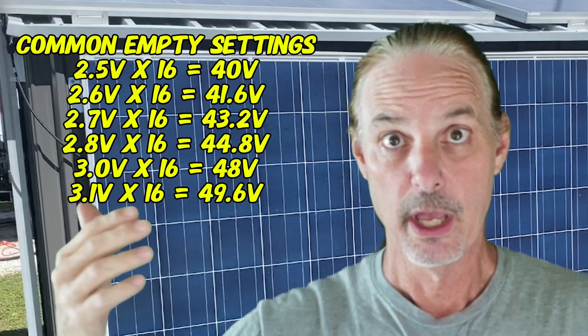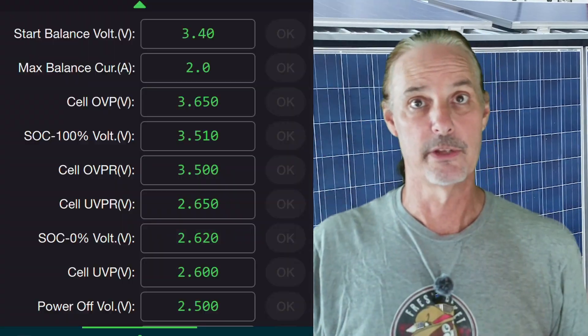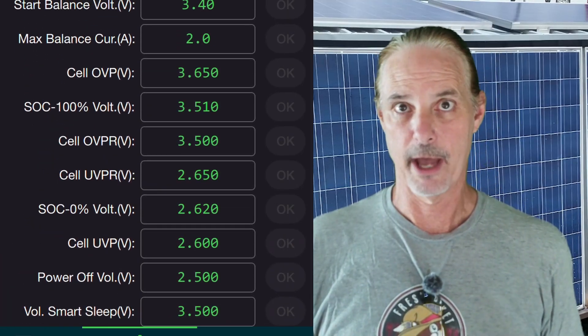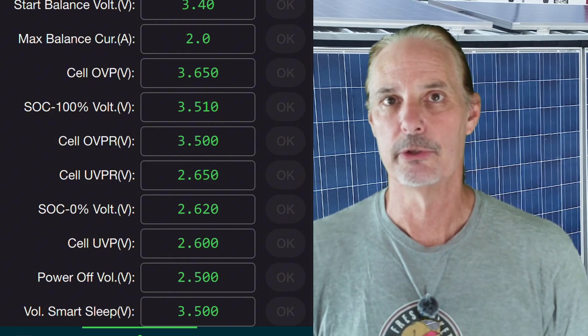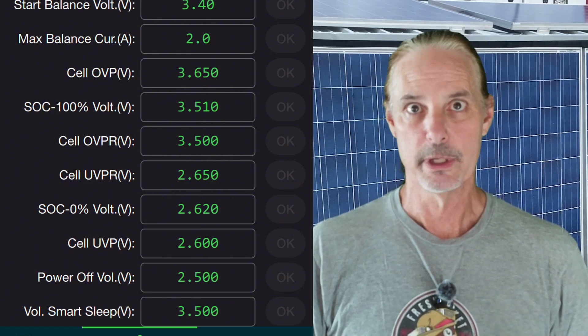You could take it all the way down to 40 volts, but most batteries — the BMS — will shut off before you get there, the same reason they shut off when charging. In bottom balancing, it's going to shut off sometimes a little early because one cell that is not as strong as the others will go down faster. When it hits that minimum voltage shutoff configured in your BMS, it's going to tell you the battery is dead — even though not all cells are empty. The minimum standard is that all cells must be over a certain voltage to continue, commonly 2.5 volts.